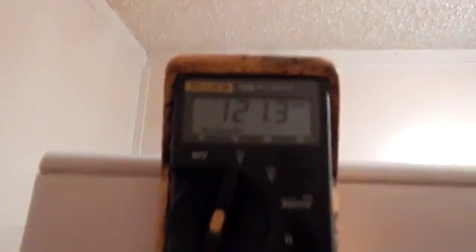There's your simple power cable connections right there. We're going to take a meter and hook one lead to the red wire, the other lead to the white or neutral wire. Turn on power and get a voltage reading. We're reading 121.3 volts, which is good — close enough to 120.